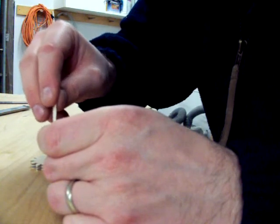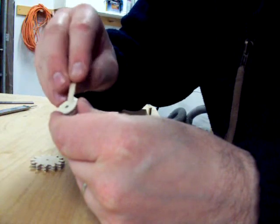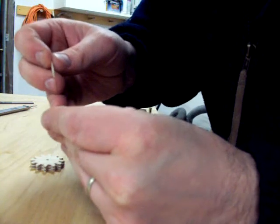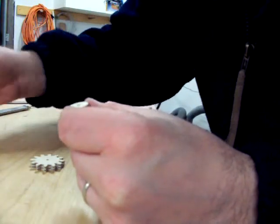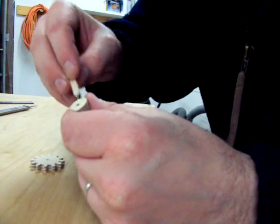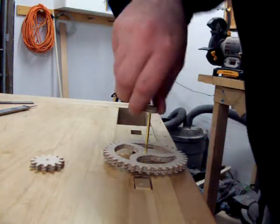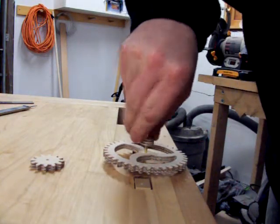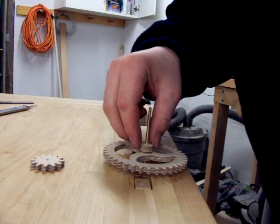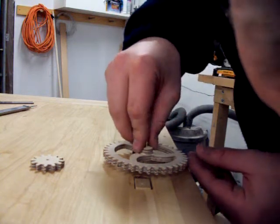When it comes time to finalize the position of the wheels and pinions on the arbor, they will need to be glued together. They are typically separated by a small wooden washer, which would be glued on both sides. Spread some glue on the wooden washer and slowly twist it in place onto the arbor. This will ease pushing onto the arbor. When you get close to the wheel, slowly push and twist to ensure good glue adhesion.